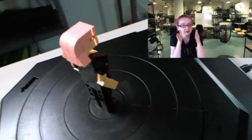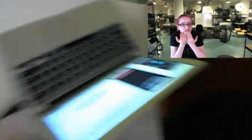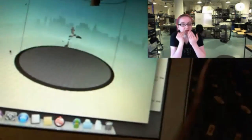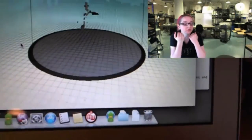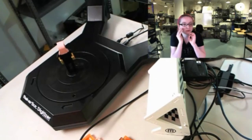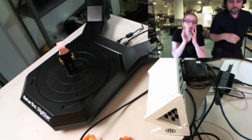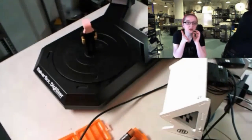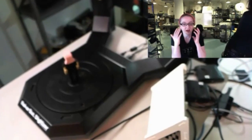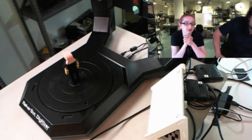There are two laser lines, and they're at 90-degree angles. The webcam is looking at the lines. This is actually a really old technique used to scan items. It looks at the laser line, and there's a filter on the webcam that looks for that red line. By seeing how it deforms from an angle, it can figure out the outside shape of a 3D object.